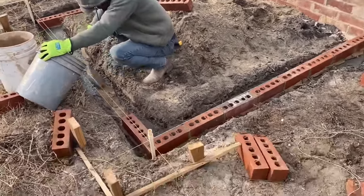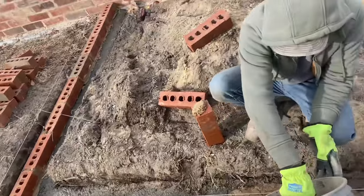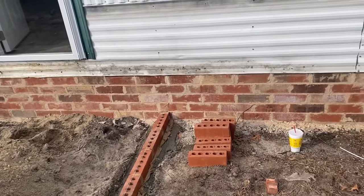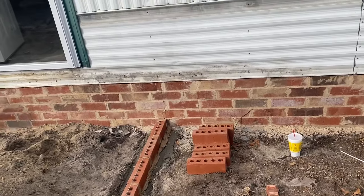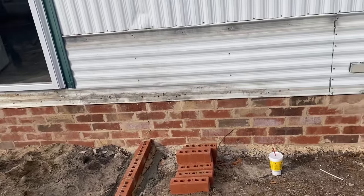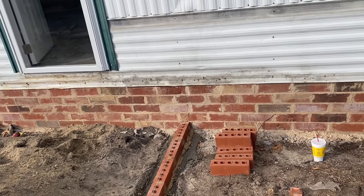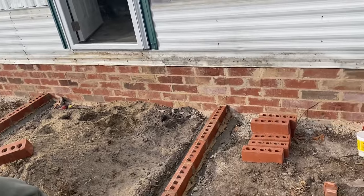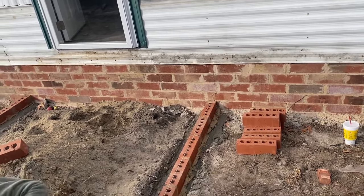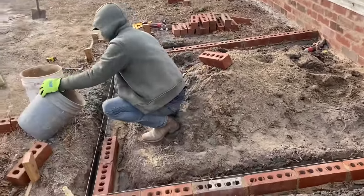They've got started — they've got that line there and this line here. That underpinning, foundation, skirting — there's a hundred different names for it. We only had 40 bricks left over. Nearly perfect guess on 1,270 bricks — it took 1,270 and we got 1,310. That's just absolutely crazy. And we did that in one trip. I took my Chevrolet down and ran and got another 150 from a guy to finish this project.